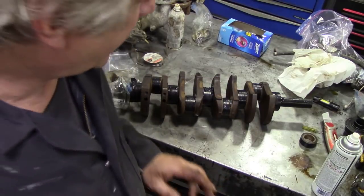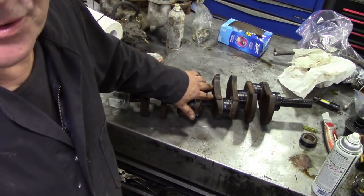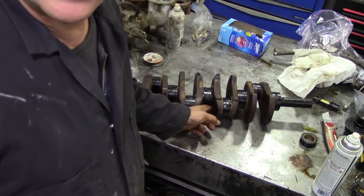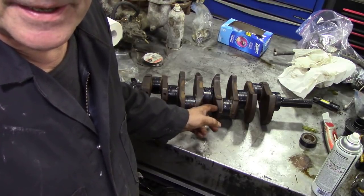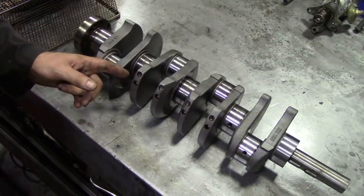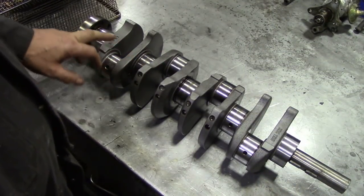I was wondering how I was going to deal with the thrust. I actually managed to turn the tape at sort of 90 degrees and with a bit of patience managed to get all this covered without exposing the surface where the bearings are going to run. Now there is a reason for this — it's not just ordinary sand. This sand is like powder. It's a 60-30 mesh, but it's been through my recirculating blaster so many times it's literally like dust. It makes a nice finish, it's not aggressive, you won't get pockmarks or pits, but it'll take the rust off. So I gave it a go. This is the finished result after coming out the sandblaster — it's perfect. I'll give it a bit of Crown rust proofing, and it hasn't gone rusty.